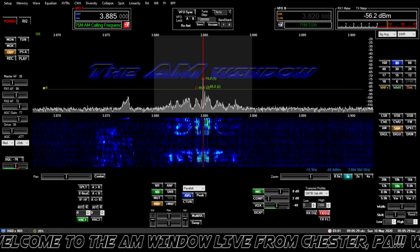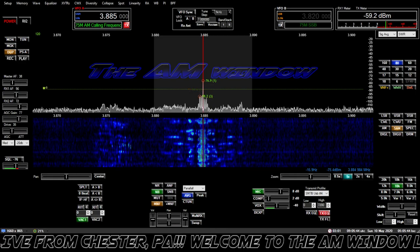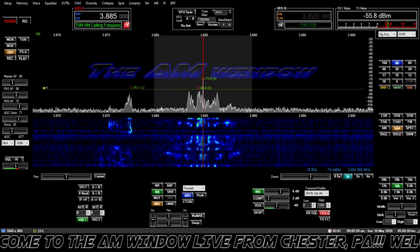is one I had tried on 20 meters for slow scan TV, to prevent what they call phase inversion dropouts. When I was doing slow scan, I could see dropouts in the image. I put up a double bazooka on 20 to reduce the amount of phase inversion, and dang near wiped it out by doing that.